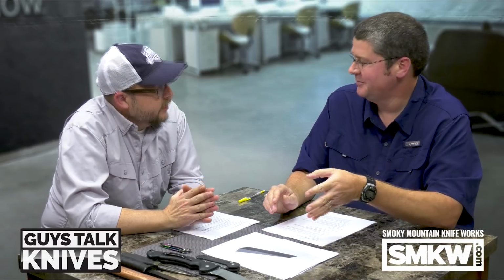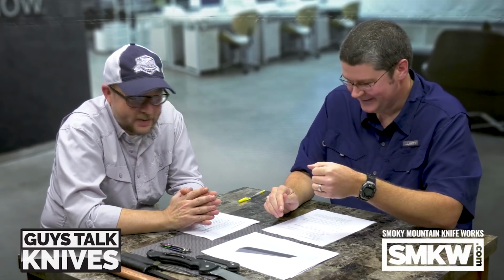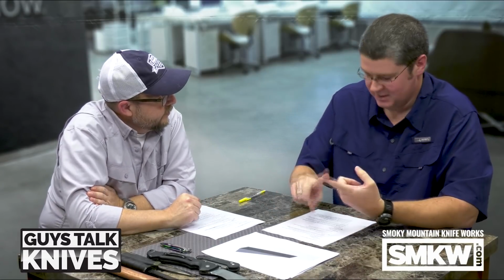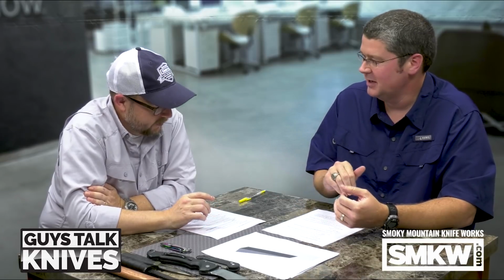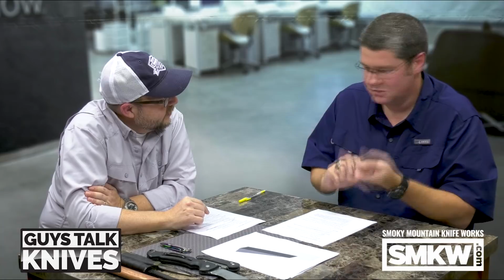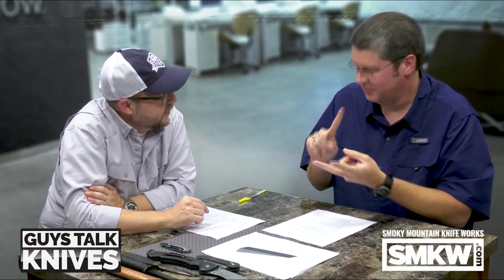Right. And those two things sound very simple. And they're not. No. And that's why most of the different sharpeners you'll find, which we're going to talk about a couple, those two things are really what they're helping you with. Right. Is keeping the angle. And they don't really help you know how much metal to take away. You need to know how to do that. But if you're approaching sharpening and thinking, this is really hard, it's two simple things. Keep the angle, only remove what you want to remove.